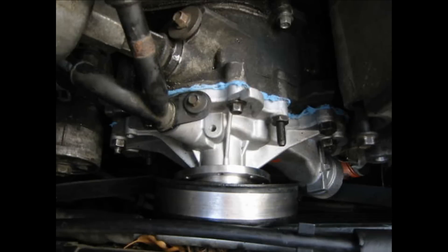Normally, most of the times when they come in here with a bad water pump, the pump will be leaking. They have a seal inside the front of the pump, and when it starts to go bad, they'll leak coolant out of the water pump. That's what we see most of the time.